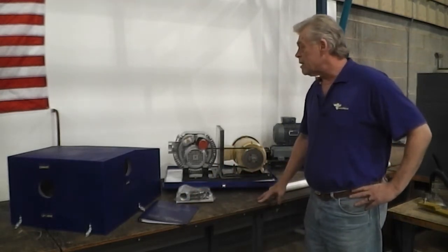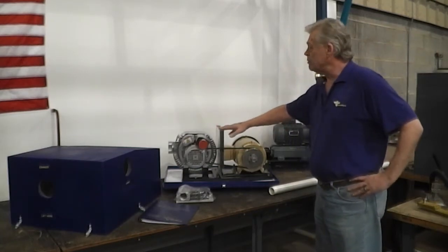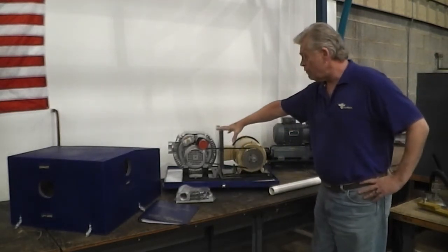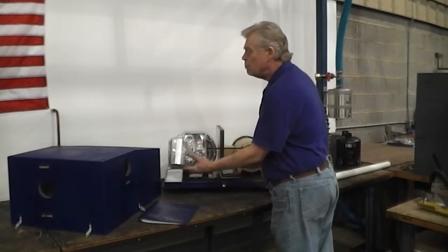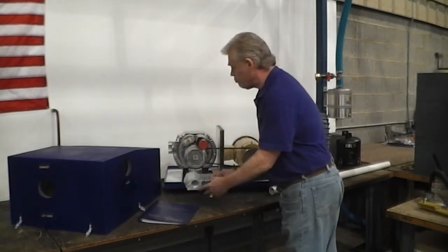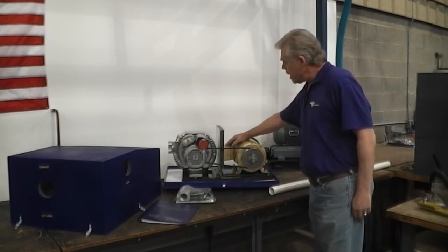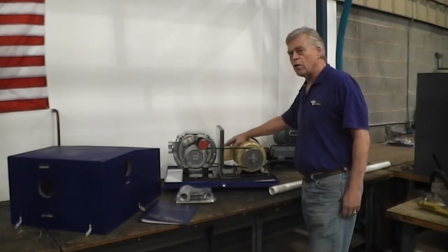If you've got one of our high capacity units, like a CM500, CM700 or larger, you're going to get an enclosed power unit. You'll receive it with this cover on. Take the cover off. There are instructions inside on how to put it back together with your exhaust muffler, which goes here, and different grommets which go to seal up these holes in the enclosure. Your takeover point for your 5-horse Baldor motor is here. It's a 230/460 motor. That's the standard. We have other voltages available.